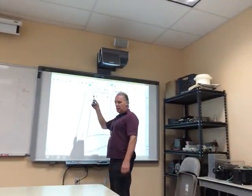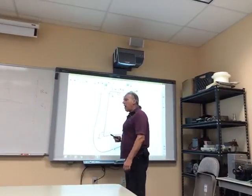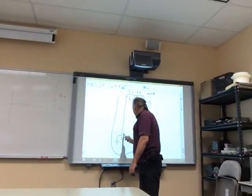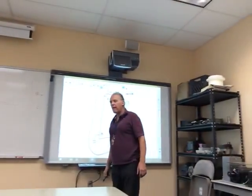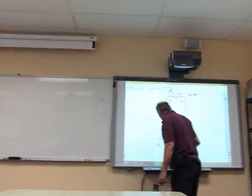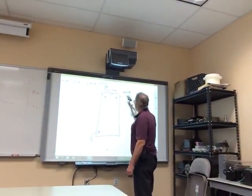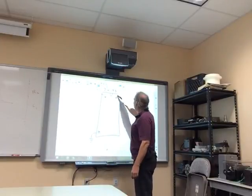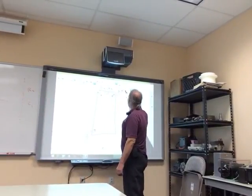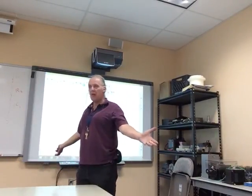All right, 14, okay? So we start here, pin 1, and we go to, how many pins are on the 193? 16. So now I know that this is pin 8 here, and it's ground, okay? And the last pin, 16, let's put it on the inside here, is B plus. And when I say B plus, that stands for battery plus, and it's whatever voltage we're working at, which is 5 volts. Okay?